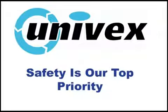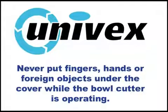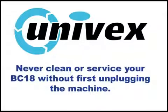Before we begin, I'd like to go over a few important safety reminders. When installing the BC18, choose a location that provides a level, stable working surface with safe operating clearance around the machine. Never put fingers, hands, or foreign objects under the cover while the bowl cutter is operating or serious injury could result. Shut off the power, unlock and raise the cover to remove the food jam. Only food is to go through the cutting zone. And finally, never attempt to clean or service your bowl cutter without first shutting down the power and unplugging the machine or shutting off the circuit breaker at the electrical panel.